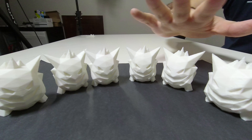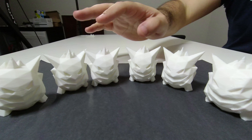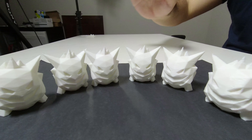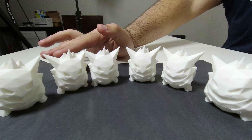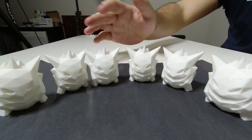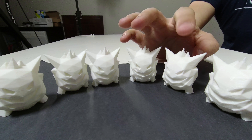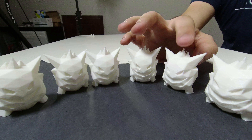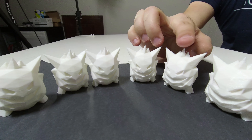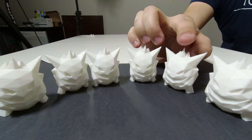It does look amazing compared against the very thickest you can go — the 0.6 millimeter printhead at 0.4 millimeter layer height. That one is chunky, but he still looks okay. I think a lot of people would still be pretty happy if their printer made this. None of these prints are horrible. Probably the worst one is the 0.35 millimeter — it's just the most messy of the bunch.